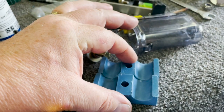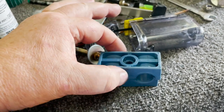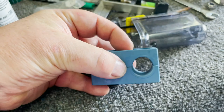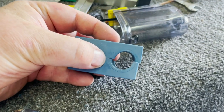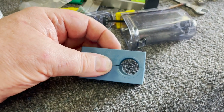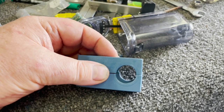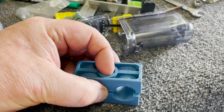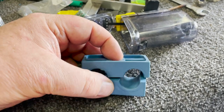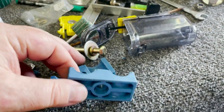If you then sand that out, you make everything else bigger, so you've got to go bit by bit. What I've been doing is bolting these together and then putting the flat wheel through the center to try and keep it concentric. The flat wheel is a nice snug fit but it's still hard going — you have to put a bit of downward pressure to get some bite into the nylon, then rotate it 360 degrees and turn it back the other way.